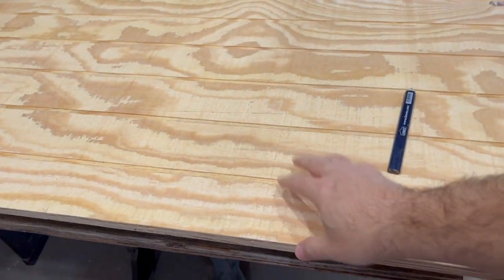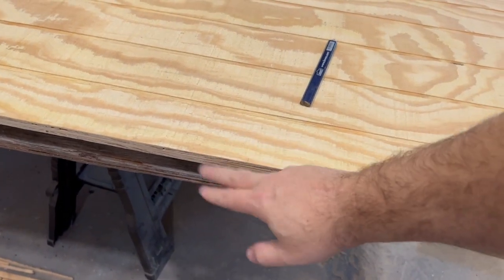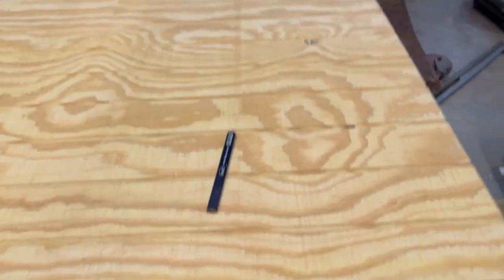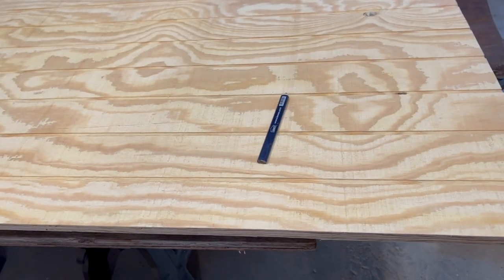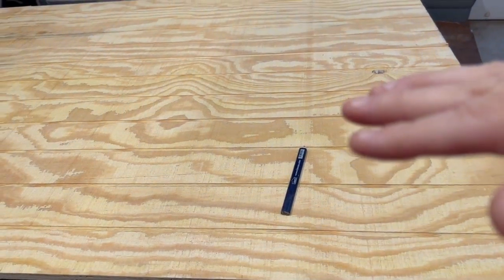What I've got here is the same thing I've used everywhere else — this four-inch on-center rough-sawed look. I've taken two pieces and backed them up together: I glued them with wood glue, put it all over them, clamped them down, and let them sit for 24 hours.